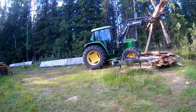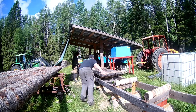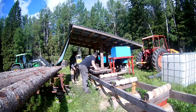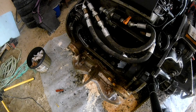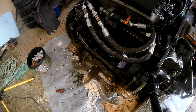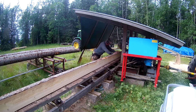The short hoses aren't actually leaking a whole lot or have any significant damage. But where the coupling is pressed in place, they seem to be drooling a tiny bit. We cleaned up the hoses better after taking them out and it still seems to leak a little. We'll clean up better, search for more leaks, and maybe change a few more hoses.